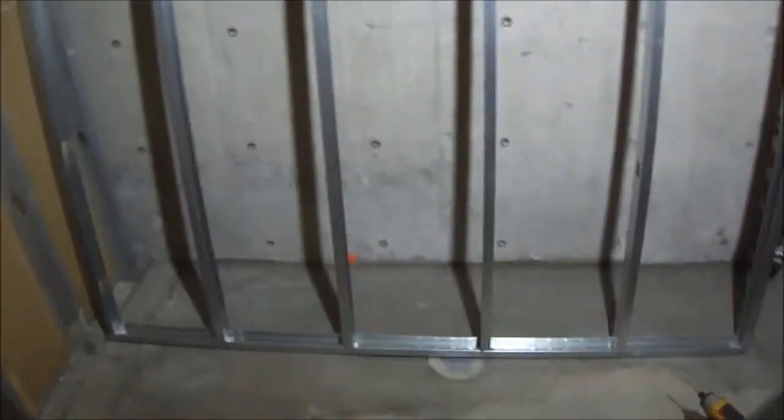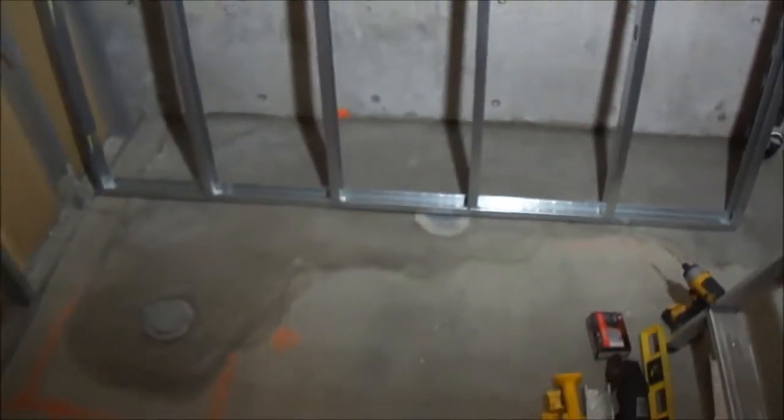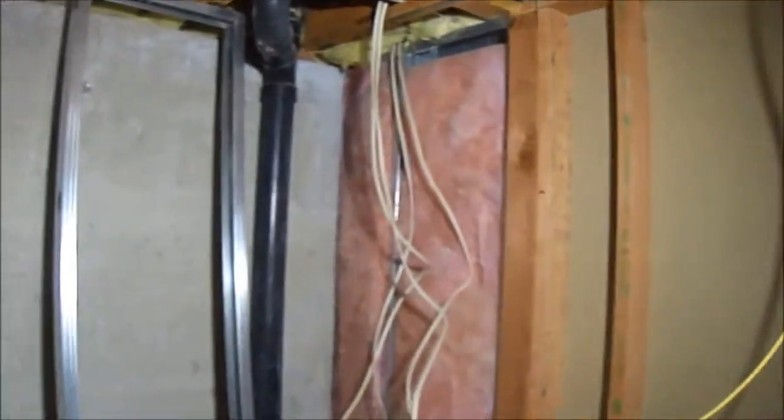I was going to show you a little project I'm working on in between the old shop truck project. Need to just finish off this basement bathroom, so hired in some plumbers to get the rough-in plumbing done, and they needed the last wall framed up. So in keeping with the theme of metal studs, I decided to continue that, and that should help for any issues with moisture over time.